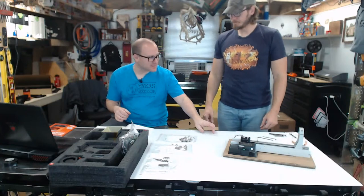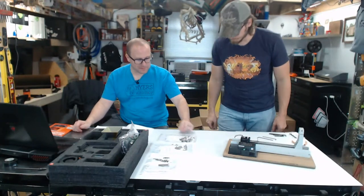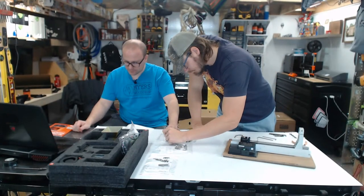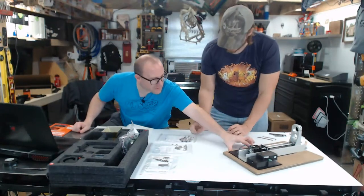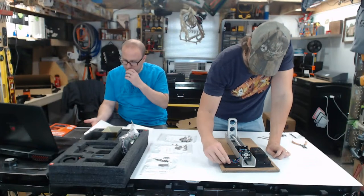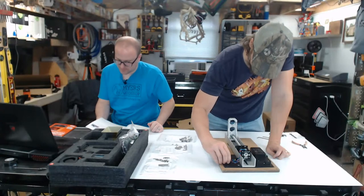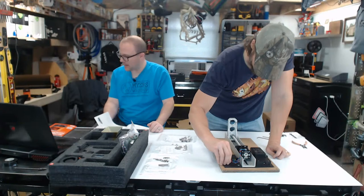All right, now we take those two, or the two little ones. Were they these? M3.5s, right? We'll say yes. You put them in these two holes. Over here. You don't sink them all the way because we're going to attach something to it later. Okay. 2 to 3 turns are enough. We'll slide a sheet on it later, so don't tighten them. Make sure each screw is perpendicular to the back plate in both axes.